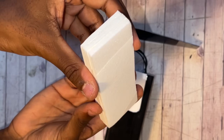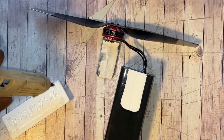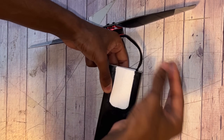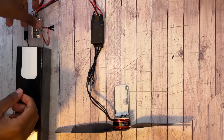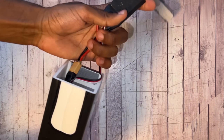Here you see a block of foam board that's going to be glued internally where the motor mount is going to be, because there's a lot of force and vibration coming from the power plant. It's important that your motor mount has some support so the foam board doesn't fatigue over time. After the glue has hardened, I'm ready to put all the electronics through the inside of the fuselage — the flight controller, GPS, and ESC are all pre-connected. When everything is inside, I'm ready to glue the motor mount in place.